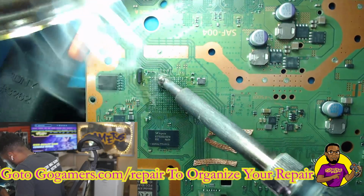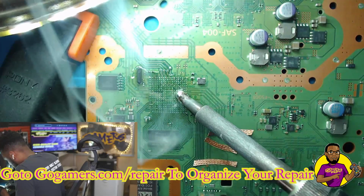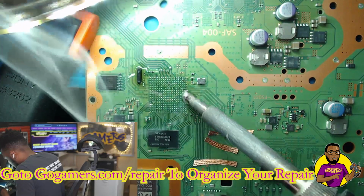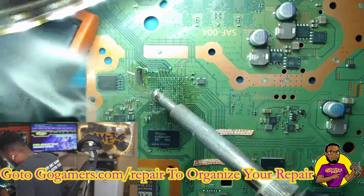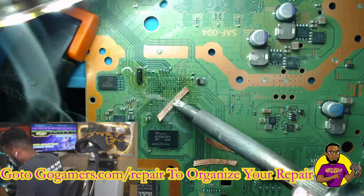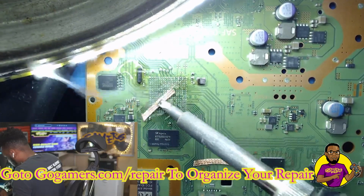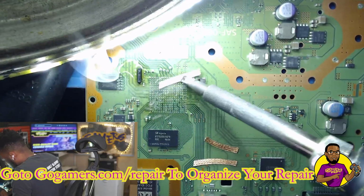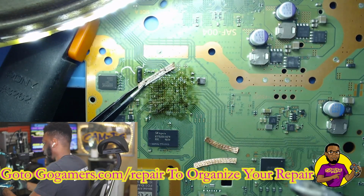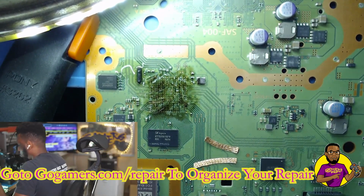What I'm going to do as well is use 1 desolder braid to desolder all of the old solder balls off the board, and then I'm going to change to the microscope to get a more clear view. So here we are with our first desolder braid strip. I'm just going around in circles. We still have enough flux on here to get all of this old solder off. You might have gotten all that old solder off with just 1 desolder braid strip, but I'm going to switch over to the microscope to make 100% sure.